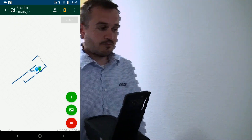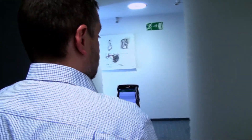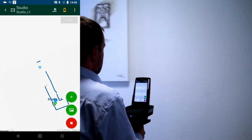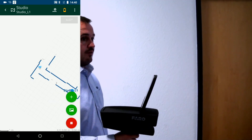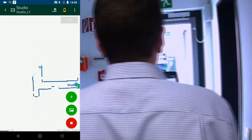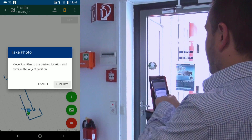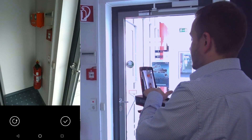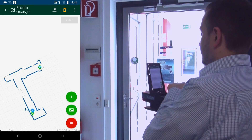I'm now going to carry on my walk. As I'm walking around and capturing data, it's always important to keep an eye on the screen. The screen gives us a live feed of the data being captured. If we notice areas that we've missed, we can simply turn around, walk back, and recapture the data. I can see in this corner there's a slight recess, so I'm just going to turn to face the recess and then carry on walking forward. It's also very important to keep the scanner horizontal at all times — that's a very important feature. I've come across another point of interest, so again I press my plus button, press picture, check that my secondary laser has come out, press Confirm, capture the data, and press Confirm again.